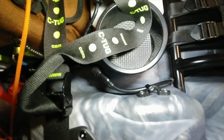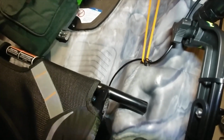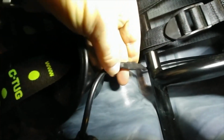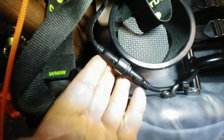So I have right down here, I ran the power cable through that. Well, it's not going through the pad eye, but I have a zip tie going through the pad eye. They're cheap enough to cut off if I want to take the whole unit off. Right now I have it running down there, and then that is with some heat shrink butt connectors, and of course heat shrink tubing on there. And then this is to one of those waterproof IP65 or whatever connectors.